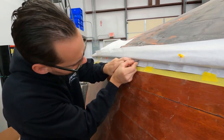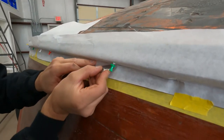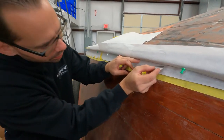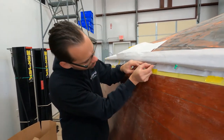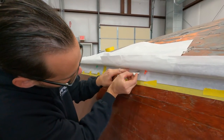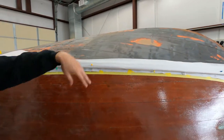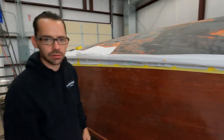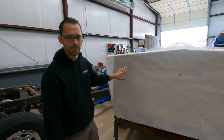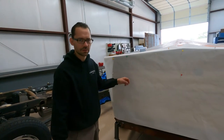I'm using a razor blade right here up in the crack and trimming it. That edge isn't going to be perfect — it'll be all jig-jaggy — but we'll straighten that out in the aluminum. I figured this would be easier to manage than trying to get that whole floppy noodle involved with scissors. Okay, we've got the side pattern done. Now we're working on the back — the stern, I think they call it. We're going to do a piece of aluminum across the back here as well, so we've got another piece of butcher paper.